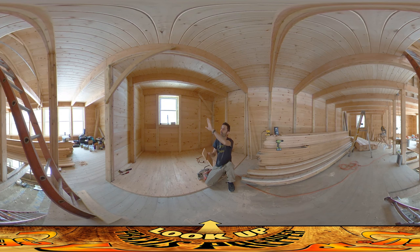To avoid that, what I did was for the last three courses of boards, instead of nailing them all up, I got them roughly in place and made it so they could bend outwards. By having them bend outwards I was able to line them all up, tap them all in together, and have them all slide into place as they went — and by doing that I was able to get a nice clean line right up at the top.